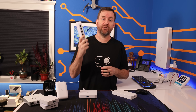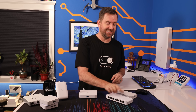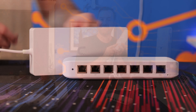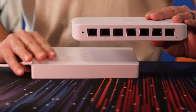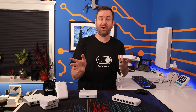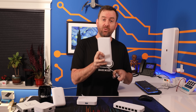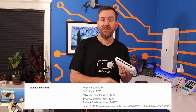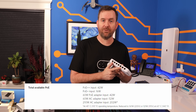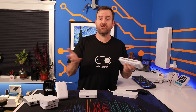You can buy the base model Switch Ultra for 129 bucks with no power adapter, or you can opt for either a 60 watt or a 210 watt AC adapter. The 210 watt adapter is just a little bit bigger than the switch itself. This increases the price if you need the AC adapter, but keeps the price lower if you don't. With the 60 watt AC adapter you get 52 watts of PoE output, and with the big 210 watt AC adapter you get 202 watts of PoE output. I can see this being useful for powering handfuls of VoIP phones or surveillance cameras.